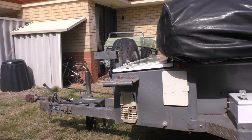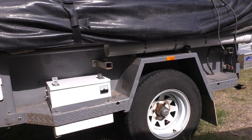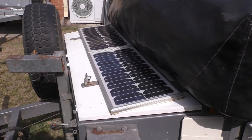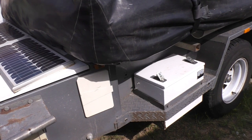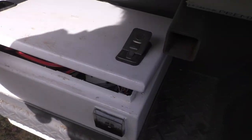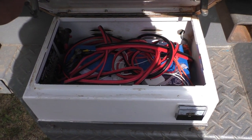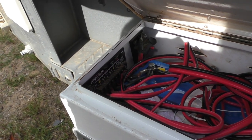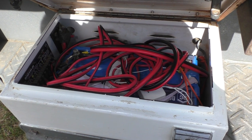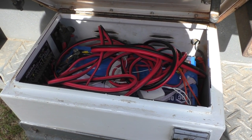This is the camper trailer that we're installing the solar system on - a 2008 model Ranger trailer, apparently built in Melbourne. It's got a solar system on it but the panels on that are pretty small, and I had no way of telling really what condition the original battery was in. So what I've done is simply installed the new Full River battery - it was just a matter of swapping the batteries over. There is an old solar controller in there - you can see it just in the corner. What I've done is added another set of cables so that we can put the new controller on it. Now I'll just go and get that and show you how everything links up - very simple: just plug in a couple of Anderson plugs, set the panels up, and it's done.